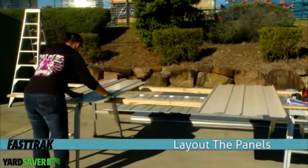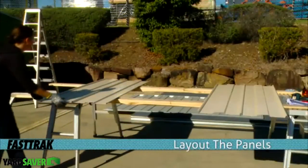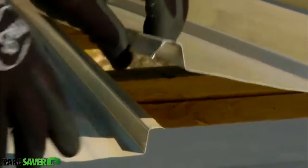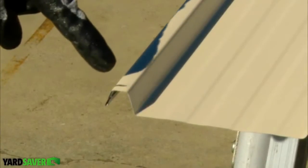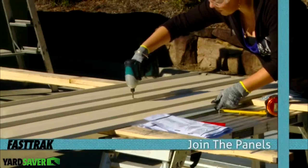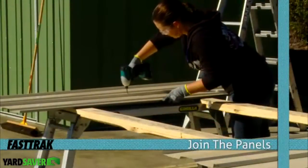Select your front wall panels according to the instructions and lay them out overlapping each other with a larger rib over the smaller rib. Make sure the large ribs on the panels are positioned at both outer edges of the front wall. Line the panels and fix them together through the pre-punched holes where they overlap.